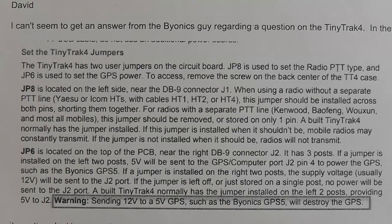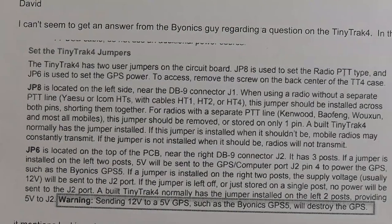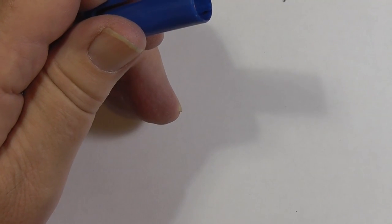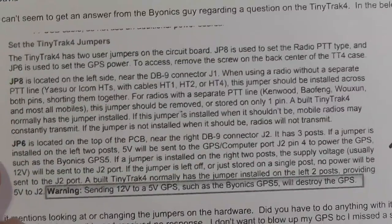Usually it's a 7805 — that's the voltage you get out. It's a very, very simple circuit. You just put 12 volts in, connect that to ground — it's a three-terminal device — and out of here comes 5 volts. That's really, really simple. You can make it as complicated as you want to, but it's really simple.